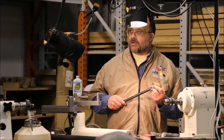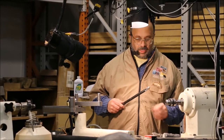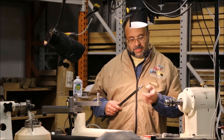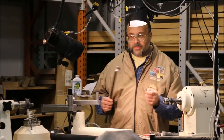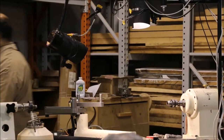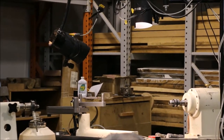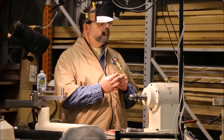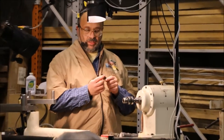The first thing I'm going to do is show you how to sharpen this cutter. The one I have in here is a carbide cutter. I'm going to be sharpening the high-speed steel cutter. So what you do is you take this carbide cutter out of here and stick it into this mandrel here. And since I have two of them, I'll pass this one around so you can get a look at what that head looks like. Now, this thing on here spins.